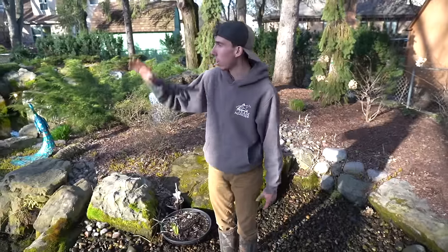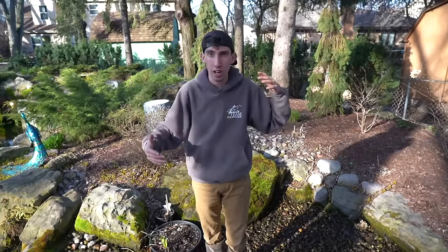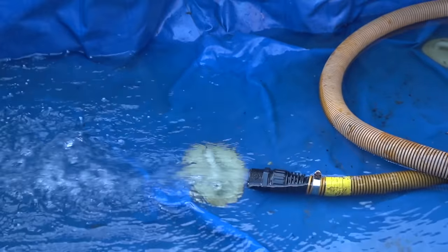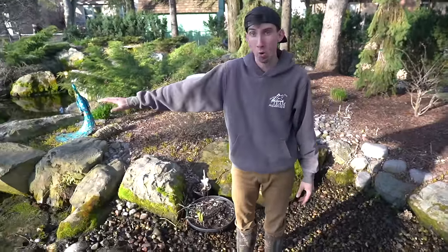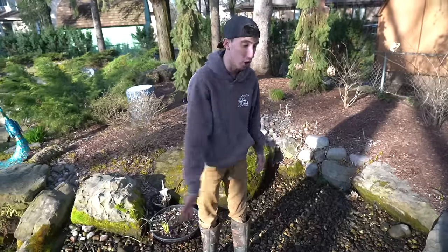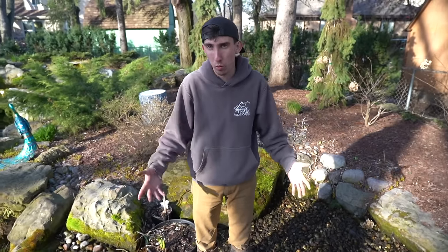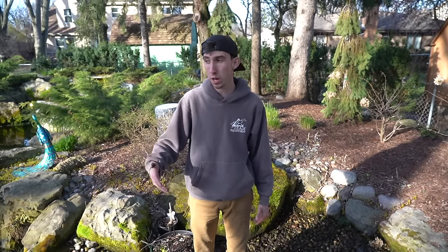You might be wondering why we have two wetlands — one here and one off to the other side by the bridge. Logistically, it did not make sense to have one big wetland in this yard; it just didn't fit. We dropped a pump down in this snorkel to fill one of the tanks with clean water. As it's draining, by the time we're set up, this will be drained and we can throw another pump down in the pond to flush all the debris and organic matter — all this sludge-type debris settling on top inside the wetland. We'll flush it all out, keeping it nice and clear for another season. This is exactly why we do a spring clean out: in nature you have a free-flowing system that pushes debris out, but with a closed system we don't have that. Draining the water, power washing, and giving it a good rinse gets everything ready for the season.